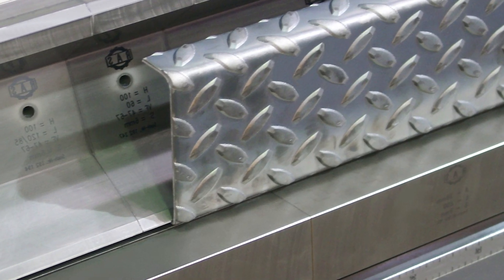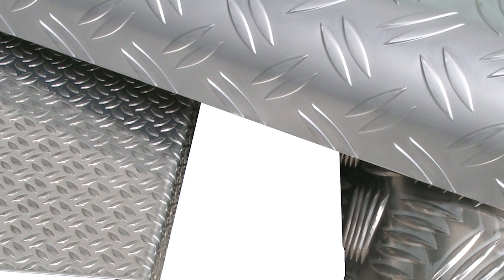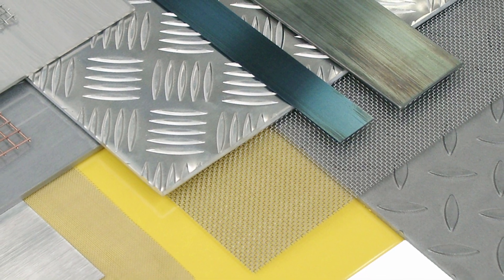Finally, let's examine embossed, diamond, or checkered plate sheet metal. The folding machine first clamps the material before bending begins. This simplifies handling, prevents the sheet from slipping, and achieves repeatable flange dimensions when bending.